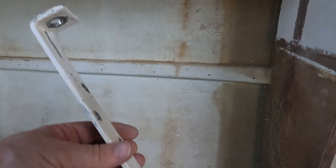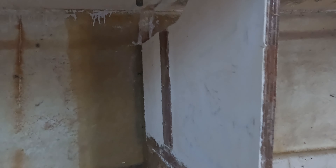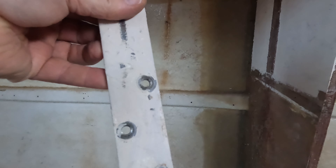These backing plates are going to beautifully carry the loads because the hull comes up and over as a shelf and then the deck sits on top of this shelf. So here you have the thickness of both the shelf attached to the hull and the deck - already this is very strong. With a huge backing plate on it, any upward load from there should neatly be transferred down the hull. Absolutely no worries about the strength - our backing plate is 30 centimetres long and the full width of that shelf.